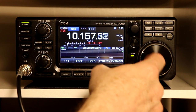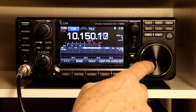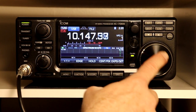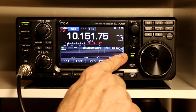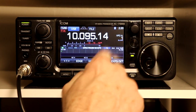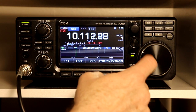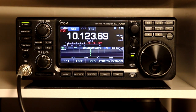If we go up to the upper end it does the same thing — you can see that the TX outline changes as you cross out of the amateur band. The other thing you will notice: I have the marker turned on in the spectrum scope, and when you go off the band you get a little green arrow that points to the right. So if you are looking for that marker and can't find it while tuning around, look on either edge and you will see a little green arrow telling you that you are outside the range of the spectrum scope.